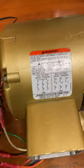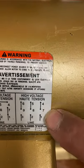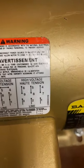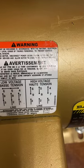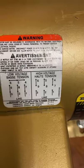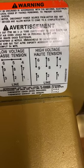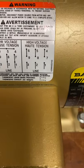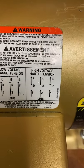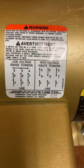As long as you know how to connect it — and I've had a lot of jobs ask me how to connect a high-voltage motor — the answer is four to seven, five to eight, six to nine, and of course leads one, two, and three. That's the most common configuration we wire three-phase motors. The majority of commercial and industrial companies use high voltage because it's more efficient and better on power. That's why high-voltage three-phase is more common than low voltage. Any questions, let me know.